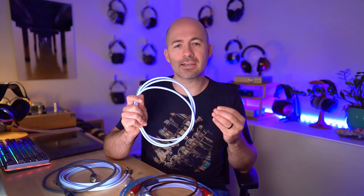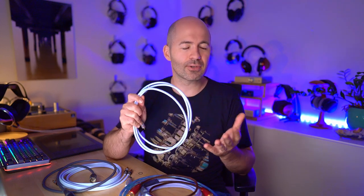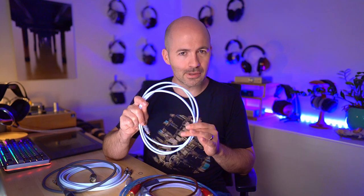That 110-ohm specification is what makes them both a digital cable and an audio cable. I should specify that for SPDIF coaxial RCA-style digital connections, my understanding is it should be a 75-ohm cable, but both the DAC-XRCA and DAC-XLR are 110-ohm. The 110-ohm XLR connection works beautifully for AES-EBU — basically the balanced version of SPDIF — but I'm not sure if 110-ohm is ideal for RCA digital. So if you think you might use these for digital, do some more research. Let me know in the comments if you want me to do a write-up of Supra's digital interconnects, including their HDMI cable for I2S and optical cable.